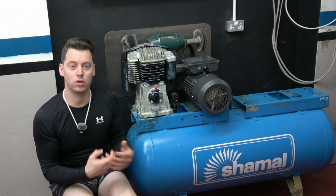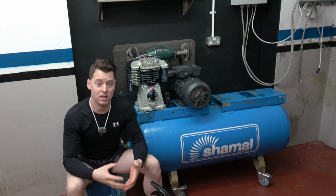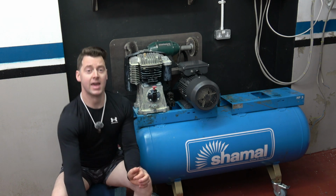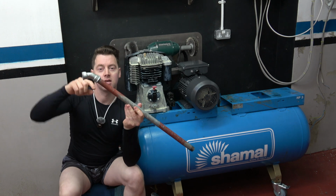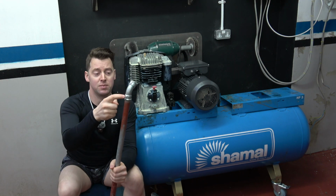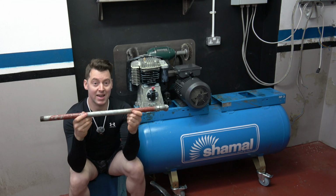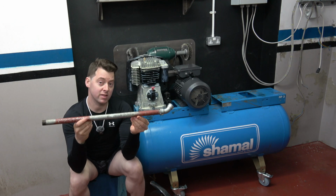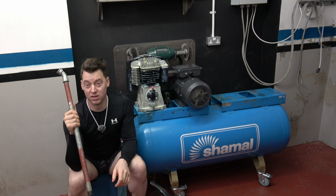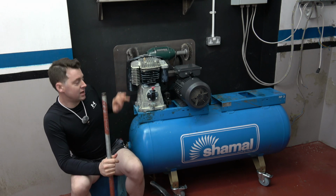So channel 1, channel 2. But also, when that's completed, I will need to reroute new suitable supply lines from both pumps to the vessel. When I say suitable, I need to spec the lines. So the pipes, the fittings, the joint type, that being flare joints or compression joints, or even these BSP fittings. So the material also needs to be taken into consideration, the sizing, the maximum temperature these fittings, these pipes can withstand, but also keeping in mind the maximum pressure of these fittings so that I don't underrate them, so that they are specified to the pump's requirements.